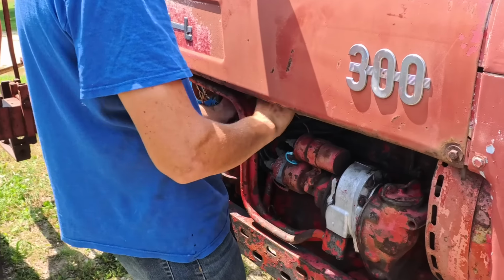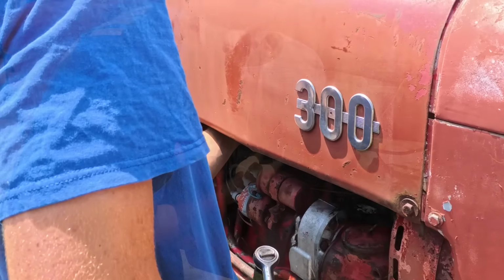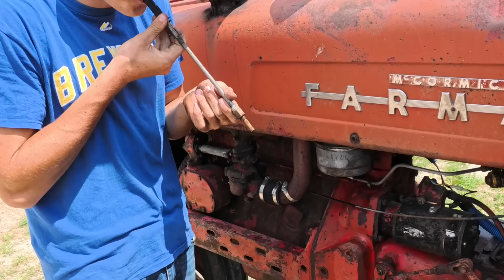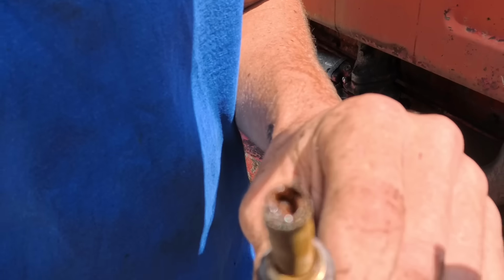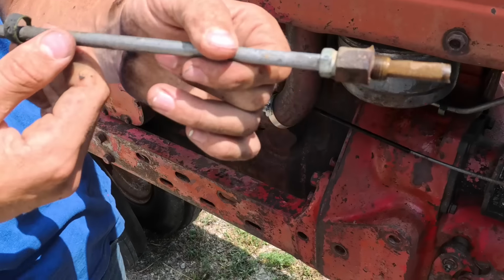Yeah, I'm going to grab a pliers on the other side and disconnect the hose on the fuel line, see if I have it flowing to the carburetor. Yeah. All right, checking out the line going into the carb. There's a screen filter on the end of it. Lovely. Oh, it looks pretty plugged. That must be what our problem was, for the most part.